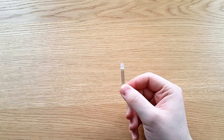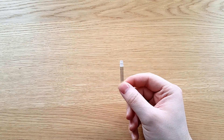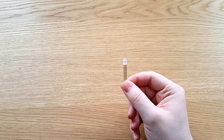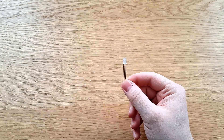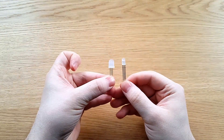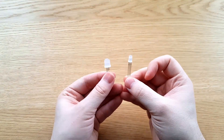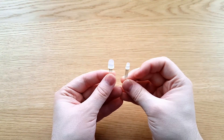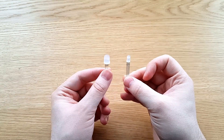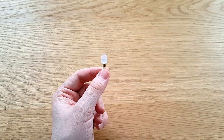So this year I wanted to make some more Christmas lights, but I want to make some for the front of the house. So we're going to make a bigger string, and instead of using these 4-pin common cathode or common anode LEDs, we are going to be using these much bigger Neopixel clone LEDs from AliExpress. The 8mm LED here is much bigger than the 5mm LED that we used last year, so this year I shouldn't have to put on a ping pong ball as a diffuser. This should work just fine by itself.